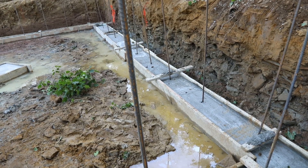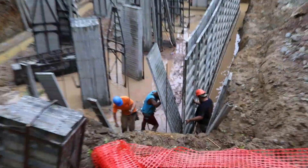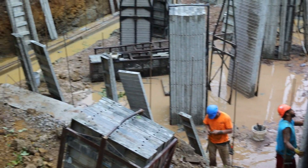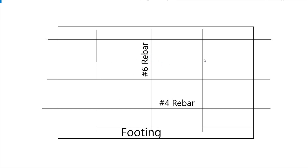In order to counteract those forces, we put steel rebar in the wall — vertical rebar every three feet along the length of the wall from the footing. We also put horizontal rebar in the wall, one in the lower third, one in the middle, and one at the top. Here's a plan view of the foundation wall showing the vertical rebar every 36 inches — number six rebar — and the three horizontal rebar at the top third, middle, and bottom third. That works kind of like a belt on a pair of pants, holding everything together so we have a solid wall that counteracts those forces from the outside.